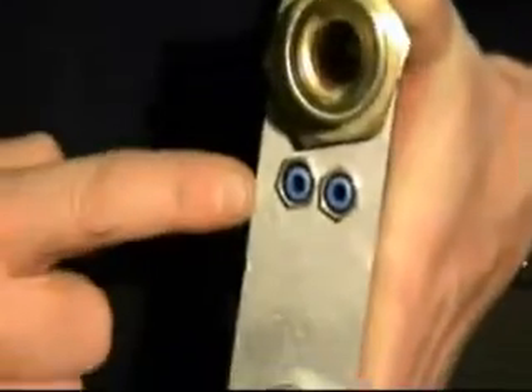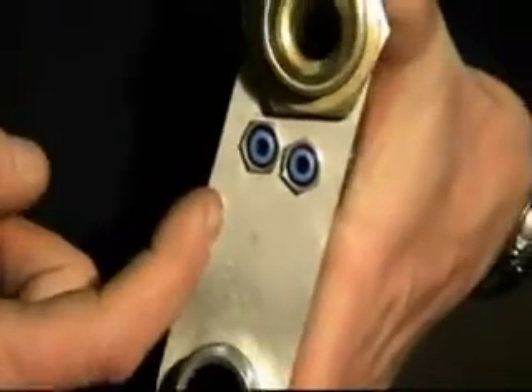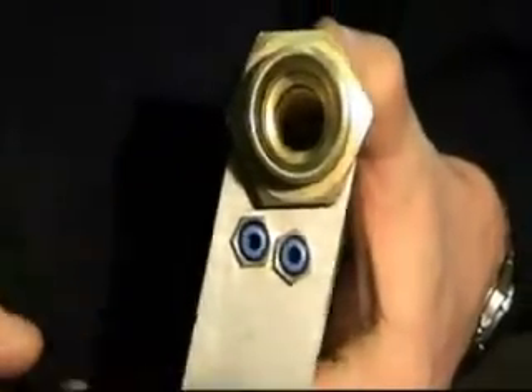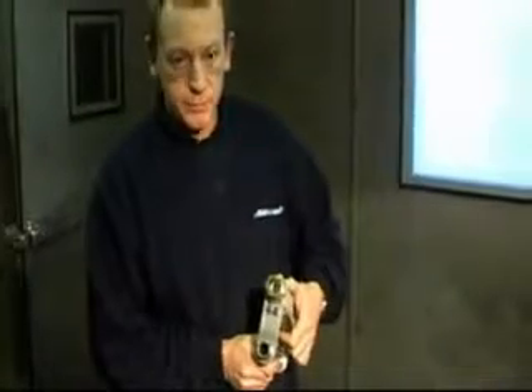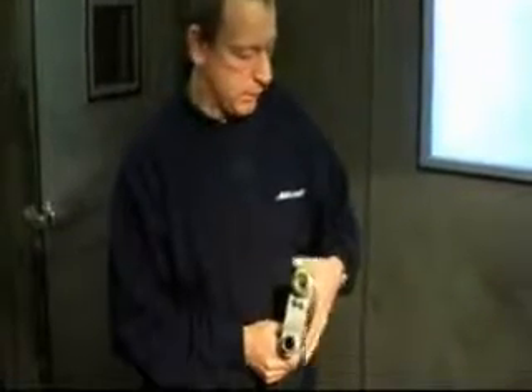It is vitally important that we get those the right way round. If they become cross-connected and you start the machine up and squeeze the trigger, the machine will start, but when you let go of the trigger the machine will not stop. So it is vitally important to make sure that those connections are made the right way round.